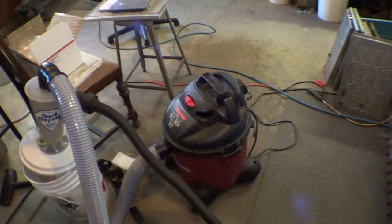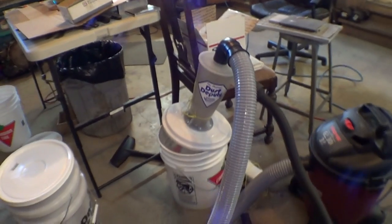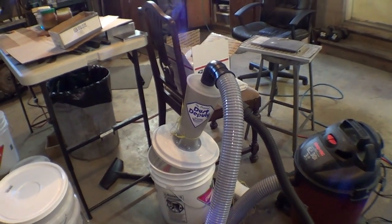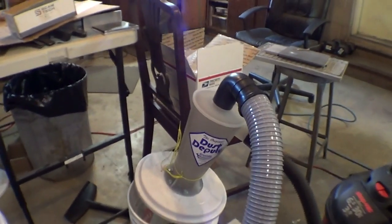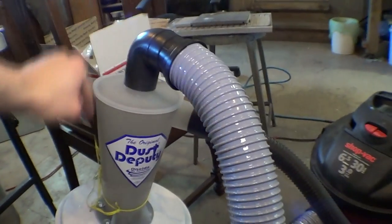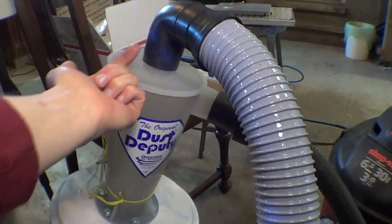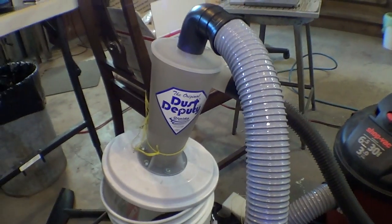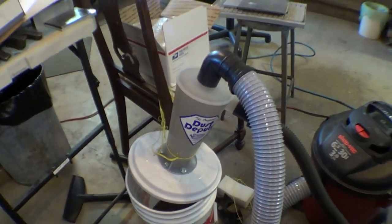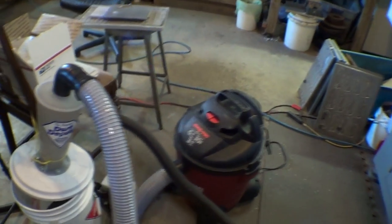It's dangerous — all that dust in the air. So a cyclone dust separator like this is really awesome. The black hose is your suction — goes in and then it just creates this cyclone effect down, down, down, and all the dust falls down, then all the rest of the air comes up this tube and out. It's supposed to be 99-point-something percent efficient at getting crap out of the air before it gets to the ShopVac at all.